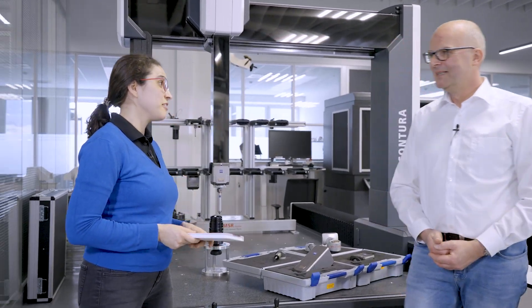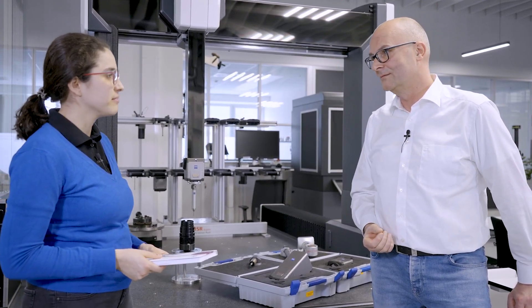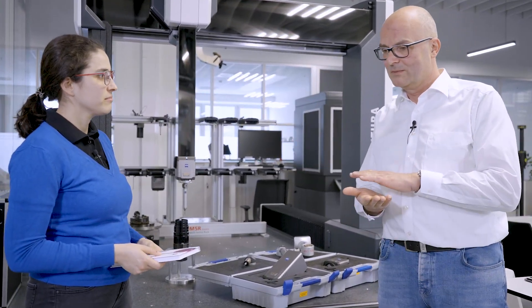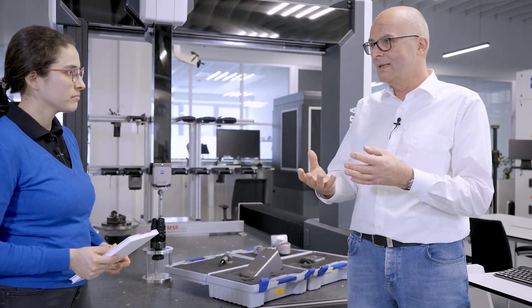So Andy, what makes tactile measurements so accurate? That's a really good question. It's depending on the application, I would say. We also have optical sensors which are exactly the same accuracy as tactile sensors — for instance, our dot scan, which is a confocal white light sensor. We have exactly the same accuracy as VAST XXT, the passive one. But there are some limitations, of course, regarding reflection from ambient lights, or also the material and which color you scan — and it's always different, which you do not have with tactile measurement. So the tactile is a bit more robust.